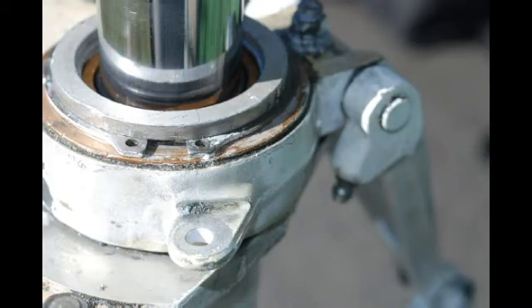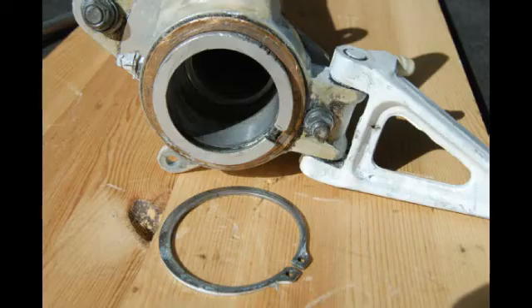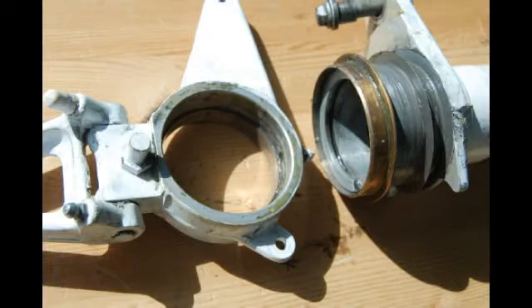With a pair of Husky snap ring pliers, remove the retainer, item 23, which we normally call a snap ring. This will give you access and allow you to remove the collar, item number 26, and allow inspection of the bearings and fittings in that area.